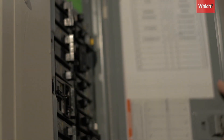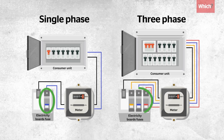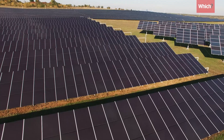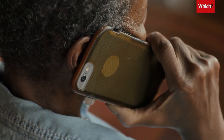You can find out what you have by checking your fuse box. One fuse means single phase; three fuses means three phase. Most of the UK electricity network does support three phase though, so if charging speed is important to you, contact your energy supplier to see if you can upgrade.